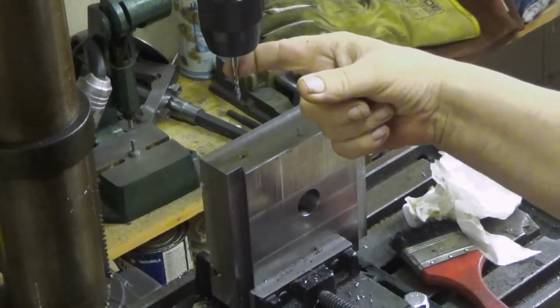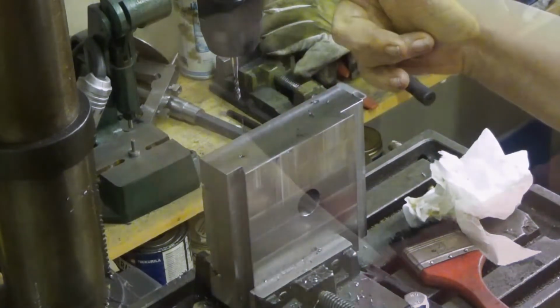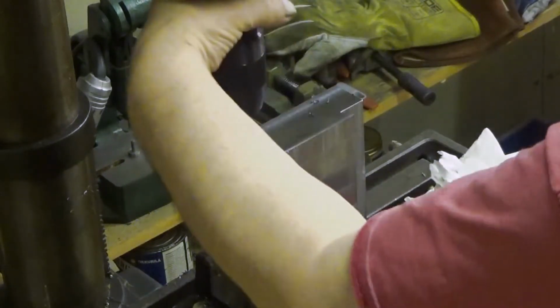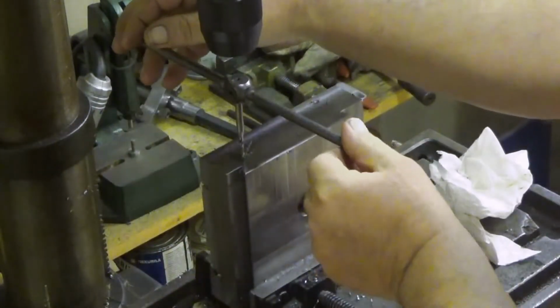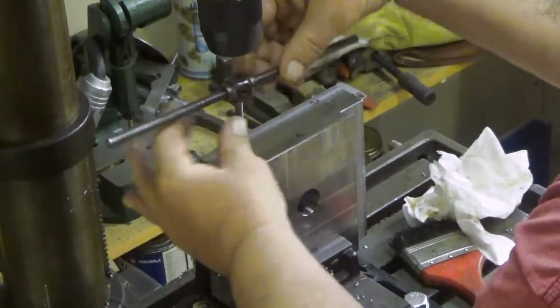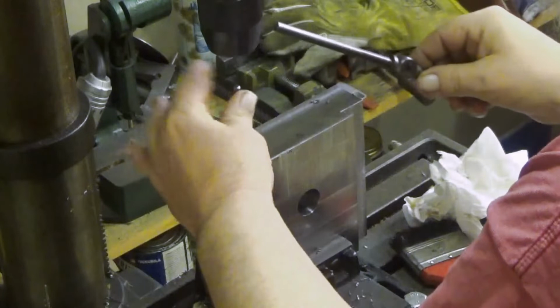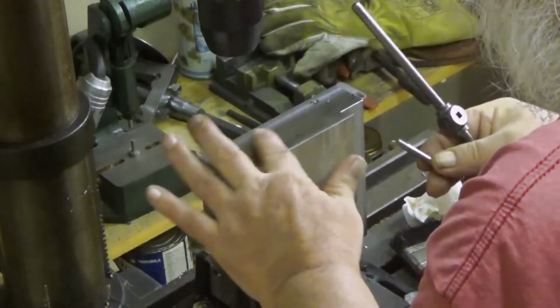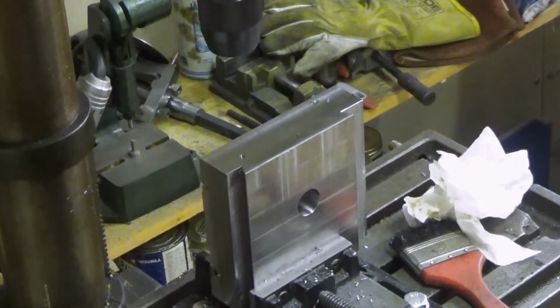Well, this is a little bit unorthodox. I put this M5 tap into my drill chuck. Let's find a suitable hole for this one. A little bit more. The famous last words, a little bit more. Oh yeah, now I don't dare to put any more. I don't want to break this tap into there. Oh yeah, it's enough. It's quite deep. Okay. Then we have a screw there which is blocking the oil from this direction.